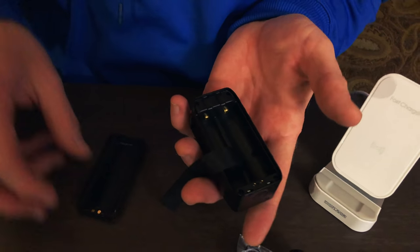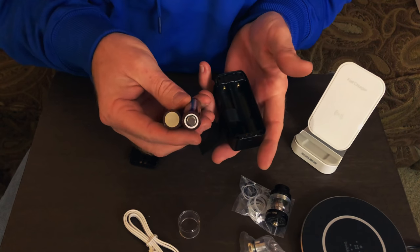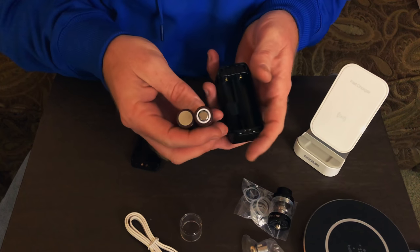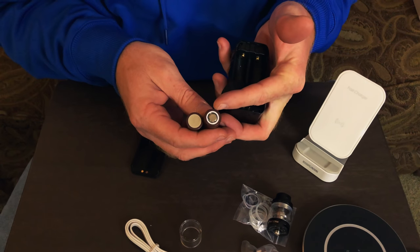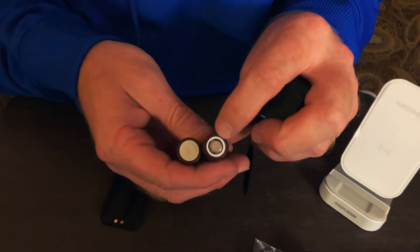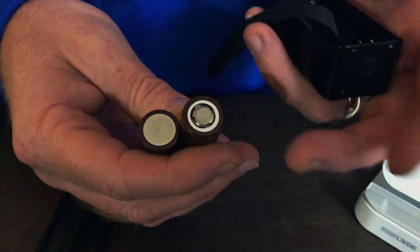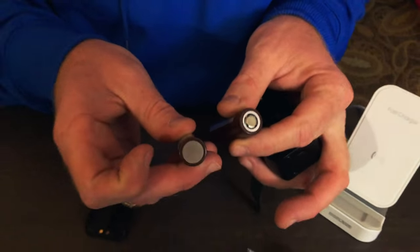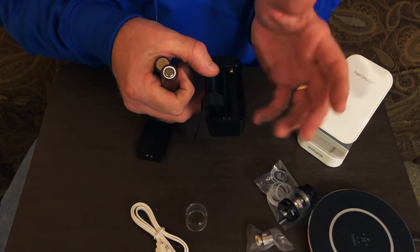The connector pins go here and that's what runs to your batteries. For you guys that may not know, here is what an 18650 battery looks like. This mod requires two 18650s, so be sure to pick up some — these are 3000 milliamp batteries. You've got to make sure that you put them in right with the positive and negative side. Your positive side is going to be here; most of the time they'll have a ring of some sort. You can see how it's kind of soldered into itself with four little bridges that connect to the outside of the battery through the shielding. The negative side is just plain smooth. Always pay attention to that when loading your batteries — if you put them in wrong, they're not going to charge or do anything.